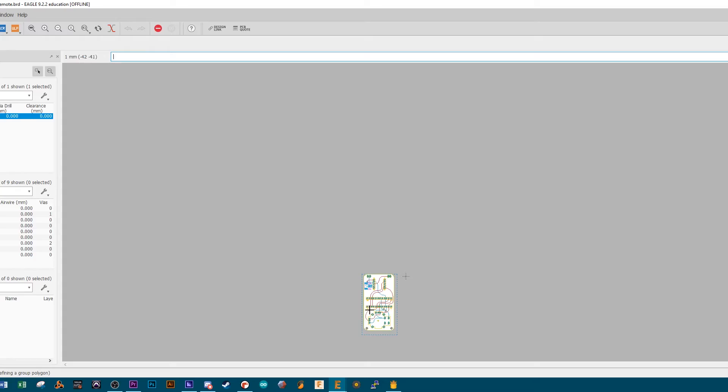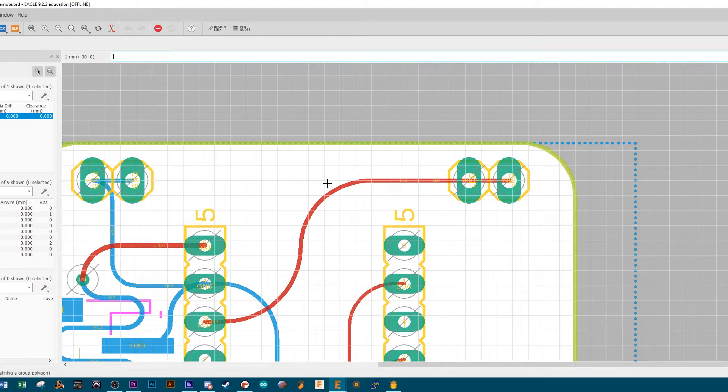The first issue came with this board. Let me show you the first one I soldered. I did the board kind of quickly, worrying only about connections. I didn't do any silkscreen labels because I figured I knew what was going on — I clearly didn't. One side is plus, the other is ground. If you hook everything up normally using the silkscreen outline, the LEDs end up facing toward you, but since this is a remote, you want them pointing out — so the connections are reversed.